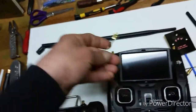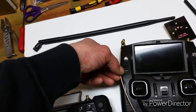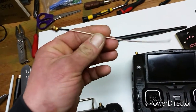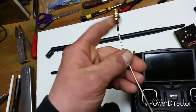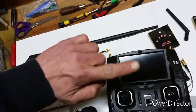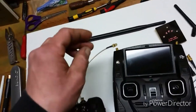For the standard antenna mod, I would probably get 4 inches — 10 centimeters — because then you don't have to loop it around. These are low loss. You want to make sure that the transmission line running from the module down to the IPEX connector is 50 ohms, because the antennas are 50 ohms. If you get a mismatch between your module, the transmission line, and your antenna, you actually lose power.